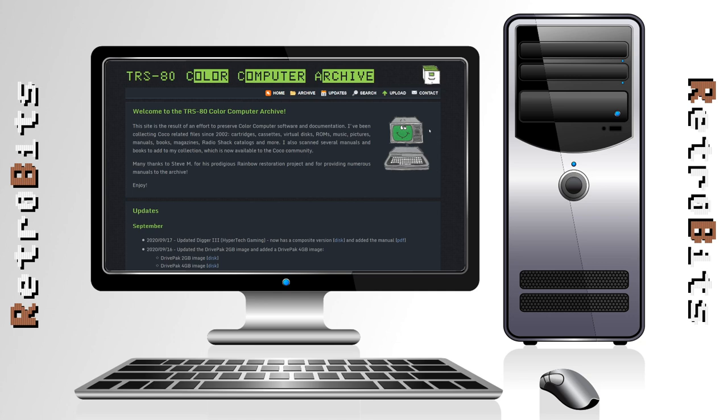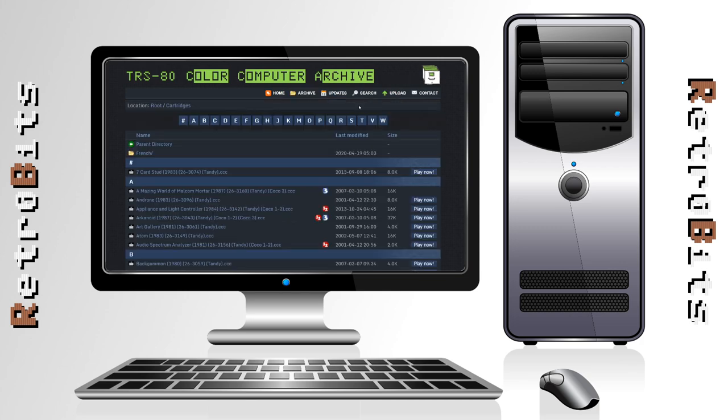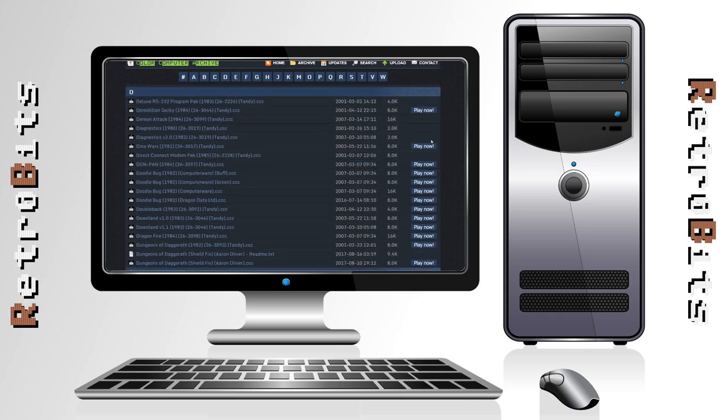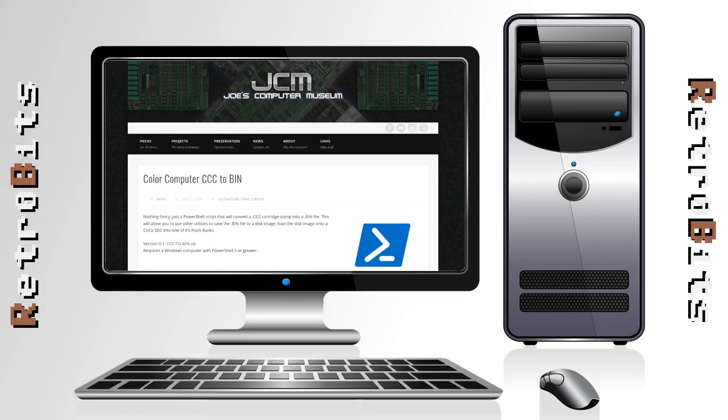The TRS-80 Color Computer Archive has disk, tape, and cartridge images available for download, so I'll grab a few from here. The images I downloaded are in CCC format, and I need them to be in bin format in order to write them to the EEPROM. Fortunately, there's just such a utility at Joe's Computer Museum.